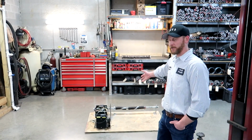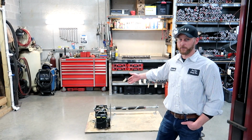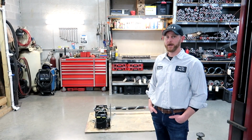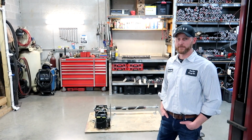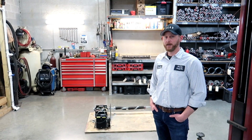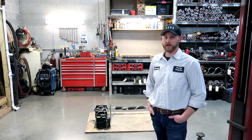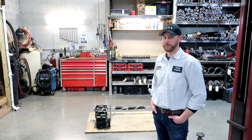But at any rate, here behind me we got the rig. It's a Liftmaster Model GH501L5, so it's a 1/2 horsepower gearhead hoist operator. It's got a 45-to-1 speed reducer. Output shaft speed on it is 36 RPM. We got a 12-tooth drive sprocket and a 40-tooth driven sprocket. We got a 1-inch solid shaft on here, and the spring is a 218 2-inch ID by 23 long. So technically the maximum turns on this spring is just under 8 1/4. We did have 12 turns on it, almost exactly when it snapped.